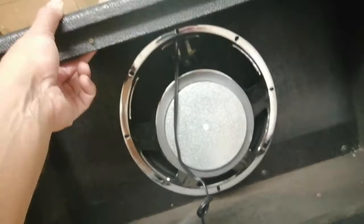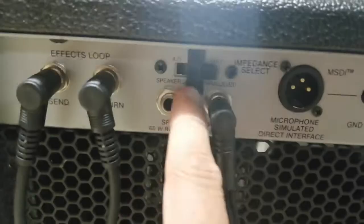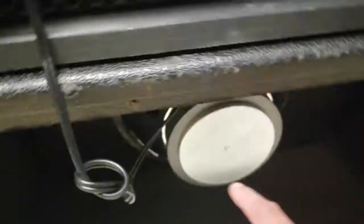This is the Sheffield stock speaker and it is 16 ohms. Some of you already asked me about this — it's really important. With the stock speaker, it is mentioned in the user's manual but not clearly in French. Your impedance knob must be set here on 16 ohm — I put tape there so I don't make a mistake. It's not written on the amp, which is a Chinese mistake — if it were written there, there would be no problem.